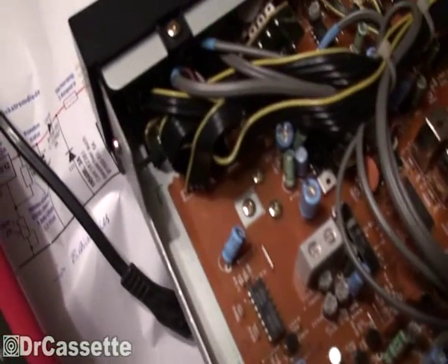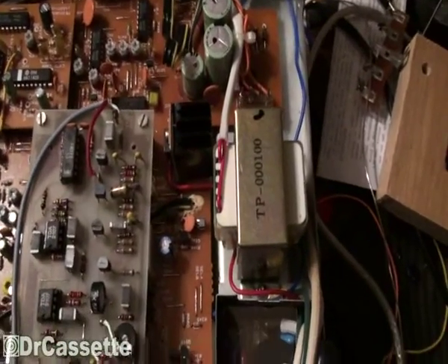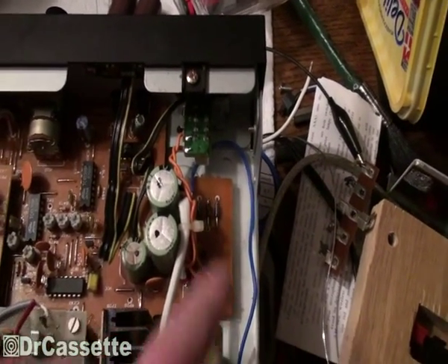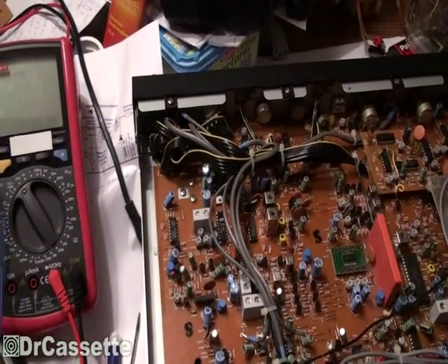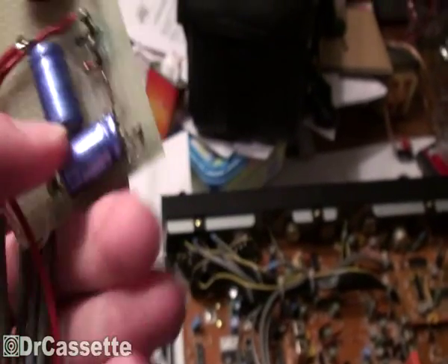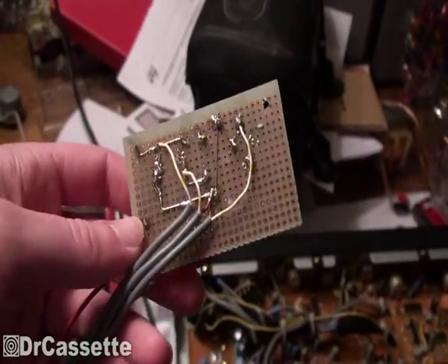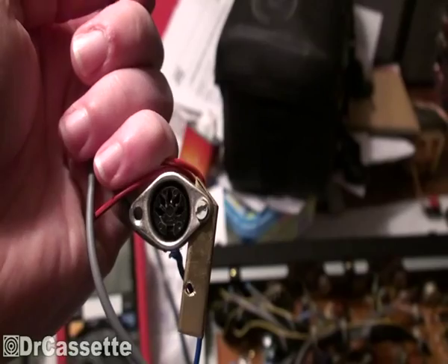As you can see, I got the weird video addition removed. Turns out it was hooked up to this unit's internal power supply, to this transistor here, and to the rectifier part right there. There are still some other wires. Anyway, this was done quite nicely — it was easy to remove everything. The unit has no active components on this board: some capacitors, some resistors, a Zener diode right there, and a potentiometer. I don't know what this was supposed to be. I guess I'll never find out, because I don't know what was once hooked up to the DIN jack.